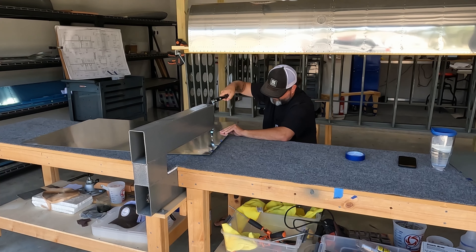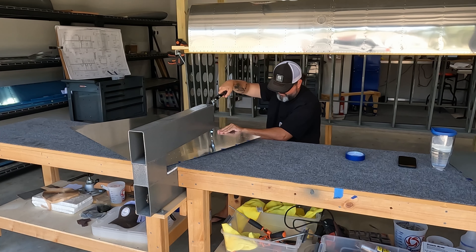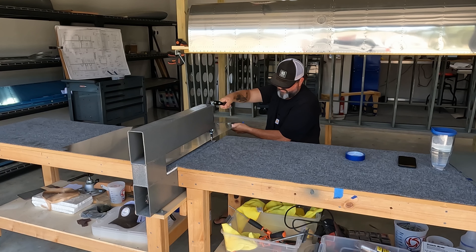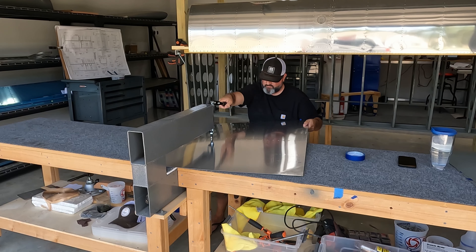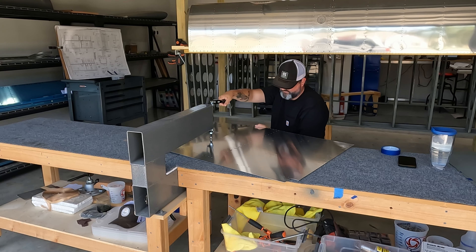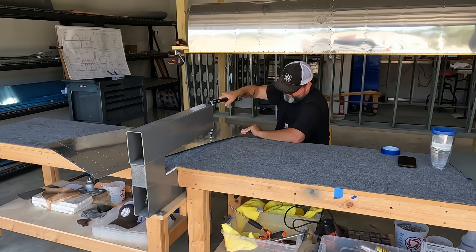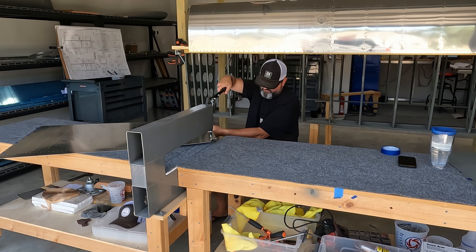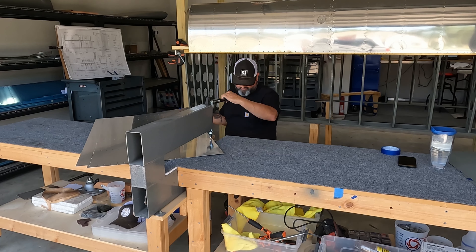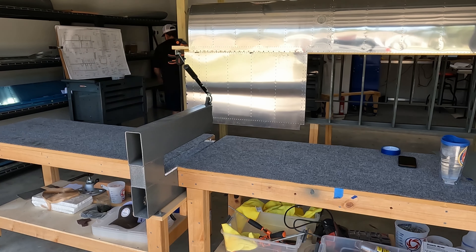I do like this setup, but if you don't want to be forced to sit down, roll on the floor, and put your shoulder in a weird position, this may not be the best setup for you. Now you can see I have it set up so that the male die is coming down to the female die. I want to address this specifically because in the very beginning when I was doing the empennage, I thought it was easier with those skins that have the big fold in them to flip it around and have the male die on the bottom, so the floppy end of the curved piece could be tilting upward - it's easier to work around the DRDT2 than if it were hanging down off the table.